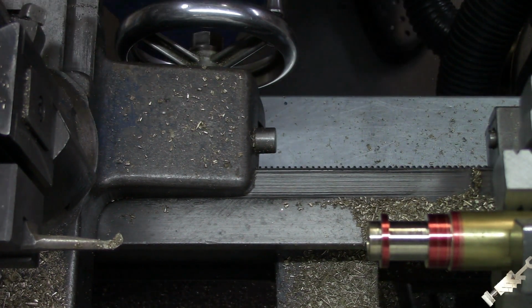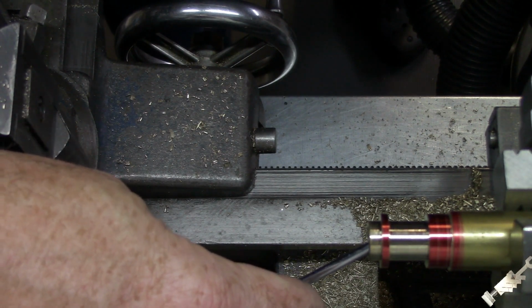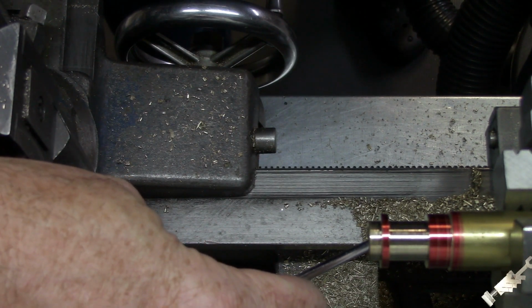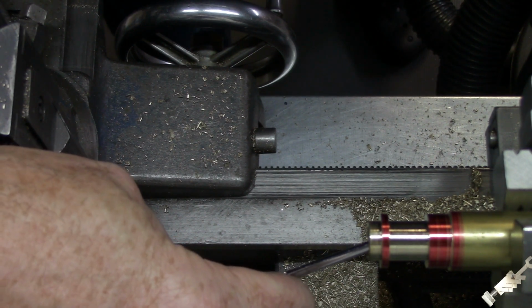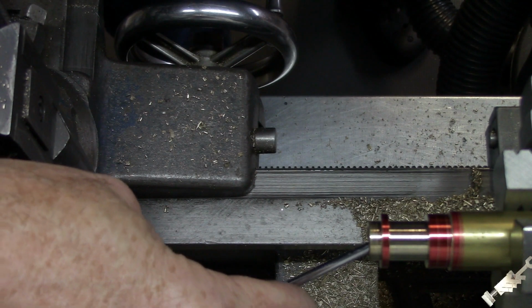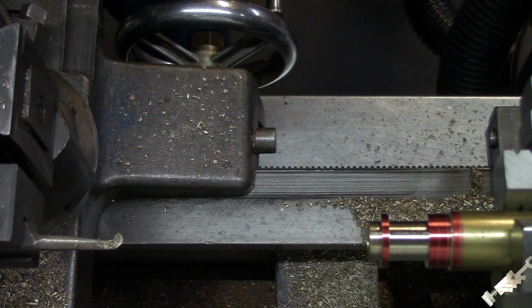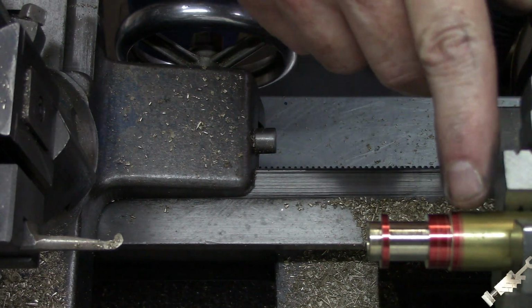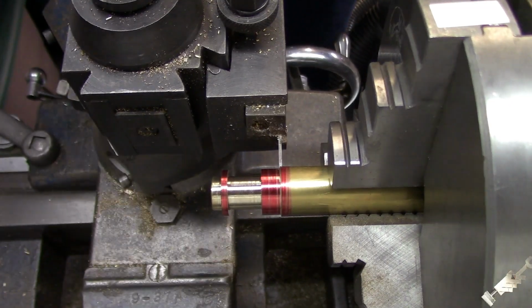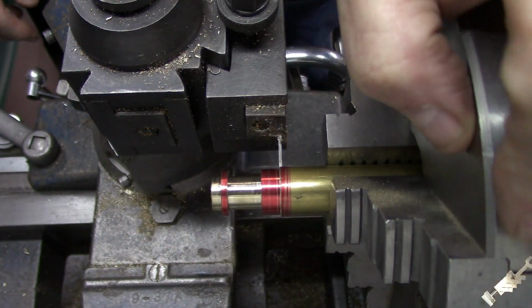Small pick and just, okay. So there, I've got a little groove in there. I could feel it, and so that should be sufficient there. So I'm thinking the next step will be parting this off. Okay, so let's part this off, and